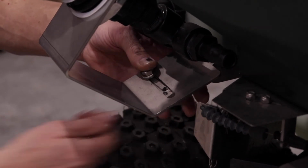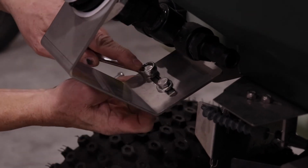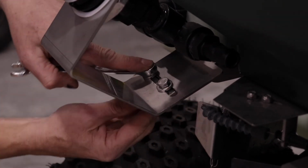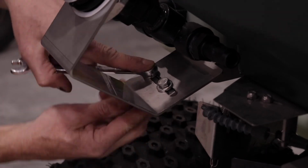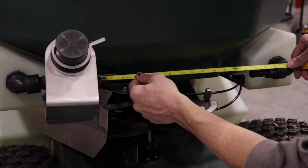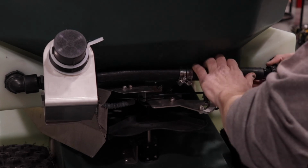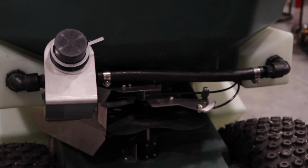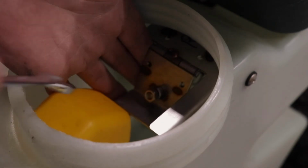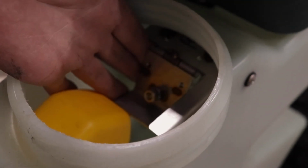Attach the support bracket to the machine using the 5/16 bolts, flat washers, and lock nuts. Tighten with the 1/2-inch wrenches, then tighten the 2-inch SS lock nut. Measure hose length required to connect the 2 hose barbs. Cut the hose to length, slide the hose clamps on, install hose onto barbs, and tighten clamps using standard screwdriver or 5/16" nut driver. Adjust to the desired fill level with the 1/4-inch eye bolt, then tighten a 1/4-inch jam nut on adjusted bolts using the 7/16" wrench.